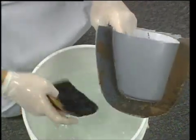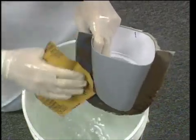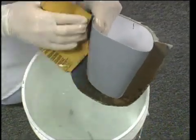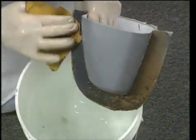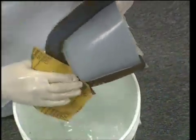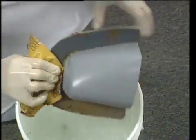After the mold half has been released, it is washed. The clay and PVA are washed off with warm water. Sometimes household dishwashing liquid is helpful, but solvents are not recommended. After washing, the surface is inspected to make sure no residual clay or unexpected imperfections are found.